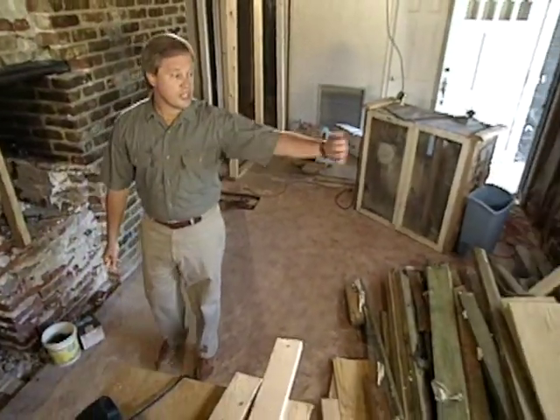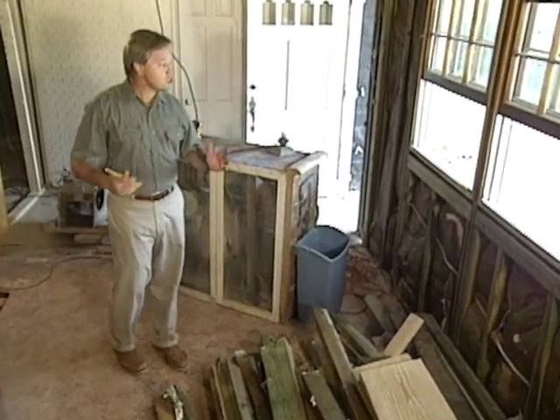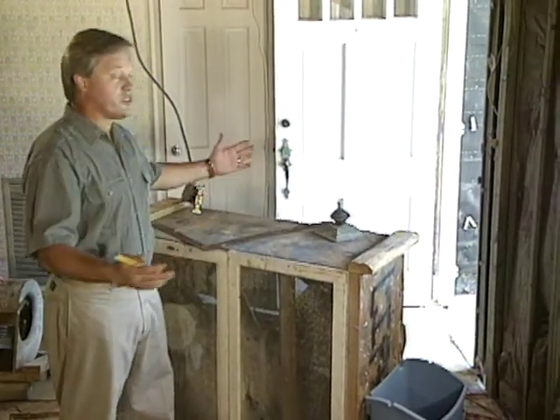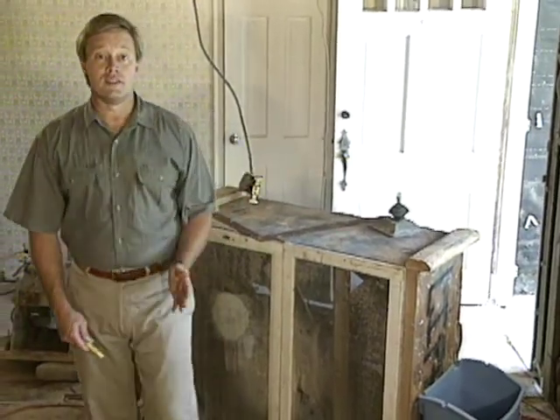With the front wall being completely removed, there are a number of lines that will have to be relocated — particularly a drain line and water lines that the plumber will have to terminate off very carefully because they'll end up right under the new floor. There are several things you need to think about if you're creating a room like this where you're really expanding an existing area, particularly if your front door is in that area. You need to think about just how separate you want your foyer area. In this case, we're installing a couple of wood columns to provide a little separation but still keep it visually open. Others may consider putting little wing walls or even a large cased opening between the foyer and the living area. The additional wall space you gain may be perfect for that piece of furniture you have for your foyer area.